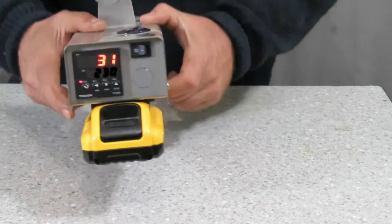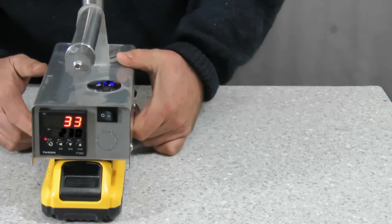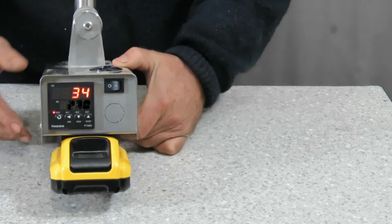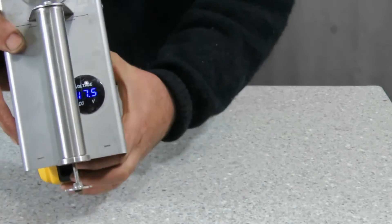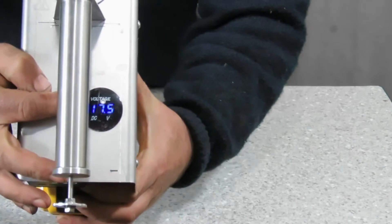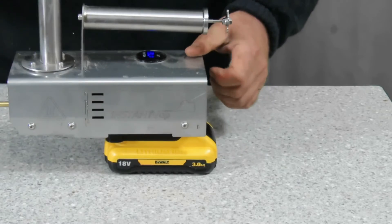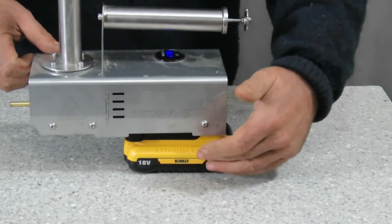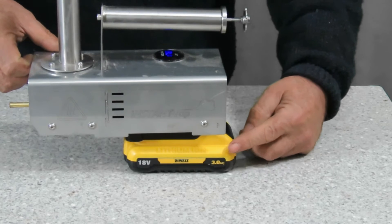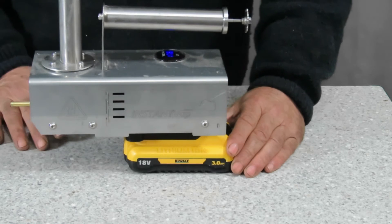What's also good about this: because it uses a lithium-ion battery, it would be very easy in the field to just keep running it until the battery is dead flat — which is very bad for the battery. So on the top of this machine there is a display showing how many volts are left in the battery, and the instructions come with clear advice about how low to allow the voltage to drop. This is an 18 volt battery; when fully charged it's at about 18.7 volts, and the instructions say don't run it below 14.7 volts.